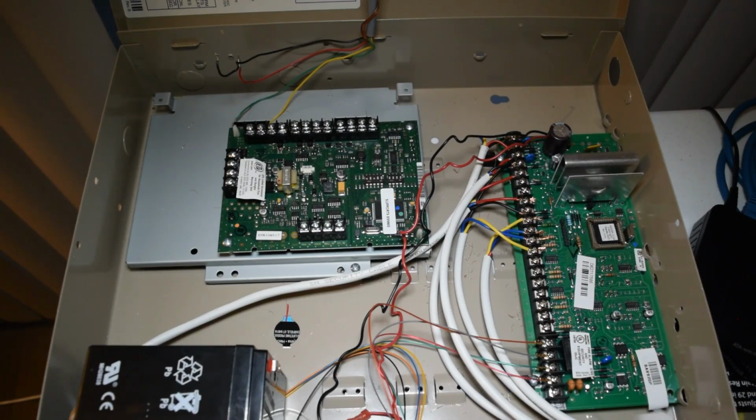If an alarm goes off on the panel, whether it be automatic detection or maybe you manually go up to it and activate a panic, after the main panel itself is done reporting the alarm to the central station, the main panel will actually transmit an additional code to the alarm receiver telling it to start listening in. And then the audio verification system module will continue to hold the phone line open. From there, the call is routed to a central station operator, like a real person.